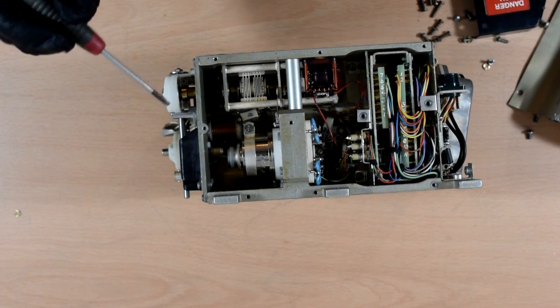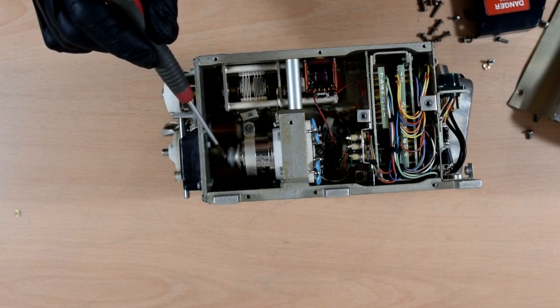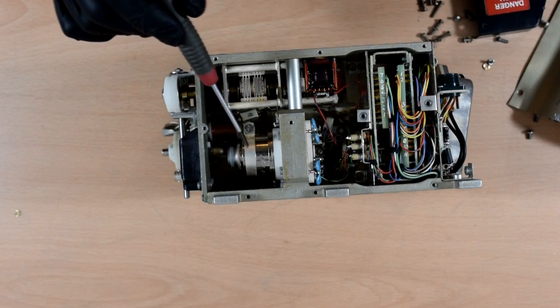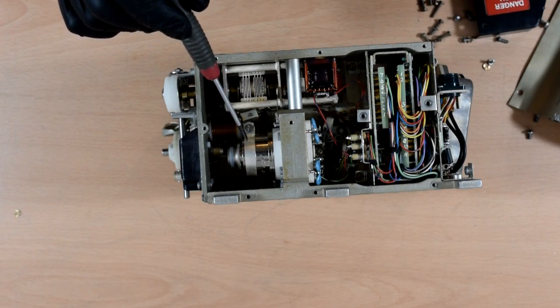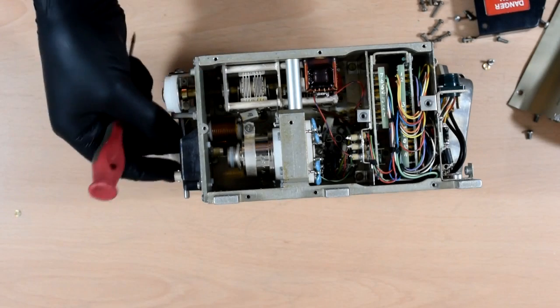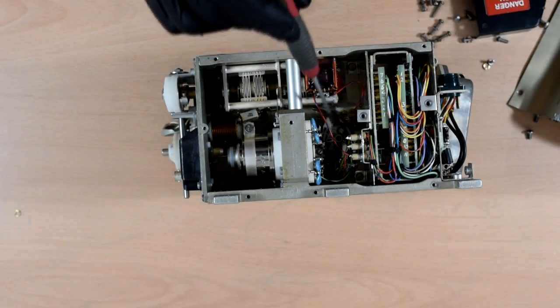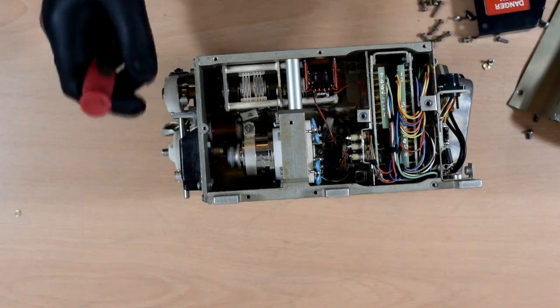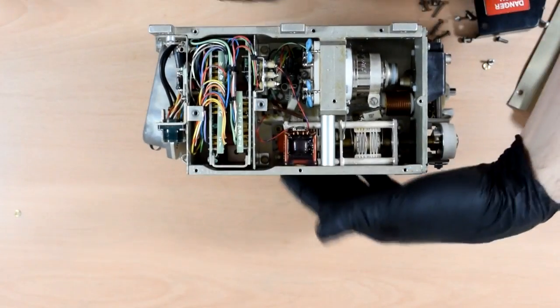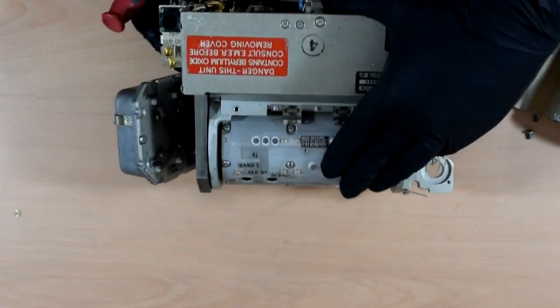Okay, so here is the main power section. We have a power valve, it looks like, in here, which is undoubtedly what needed the high voltage. An inductor, a variable capacitor here, which changes with that little motor. Some air-wired stuff down there. What else have we got here? In the back there are the contacts which connected through to this big wheel.